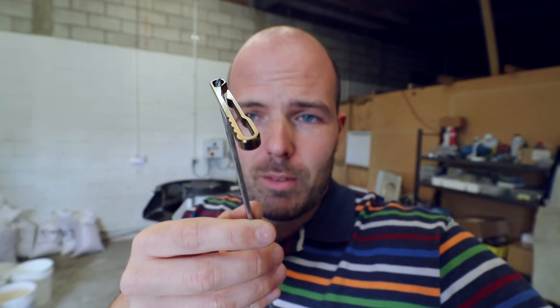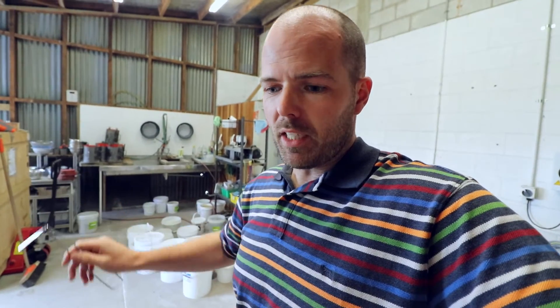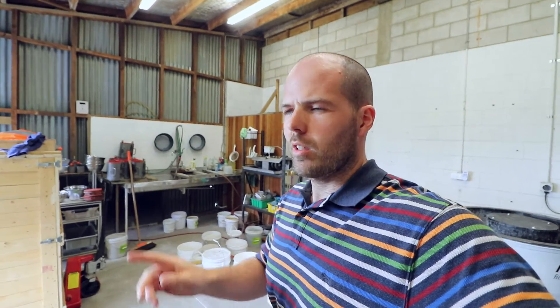That is an anodized bit of titanium done with a jet engine. I'll try it again but not right now. I had it idling at only 43,000 RPM when I did it. I might try increasing the power — here's the thing: this thing does 143,000 RPM, and if you take it up to half that, around 71,000 RPM, you only get a quarter of the power. The real power only comes higher up. It's got an exponential power curve. But at higher revs this titanium is just going to go flying across the workshop. I'm going to run it again, but outside this time.